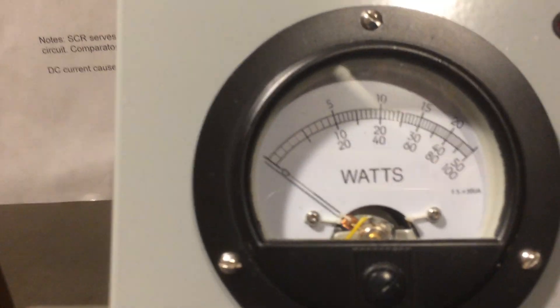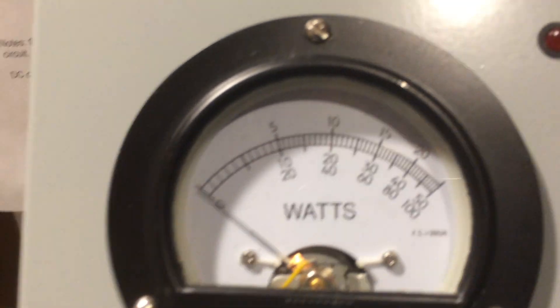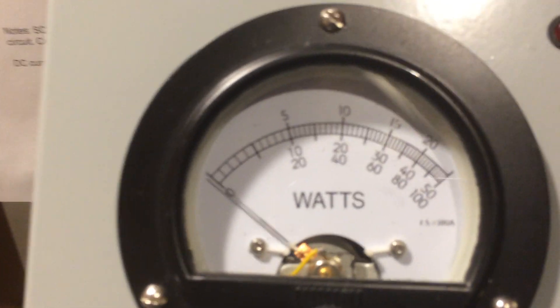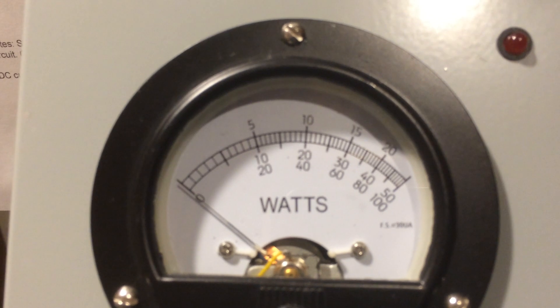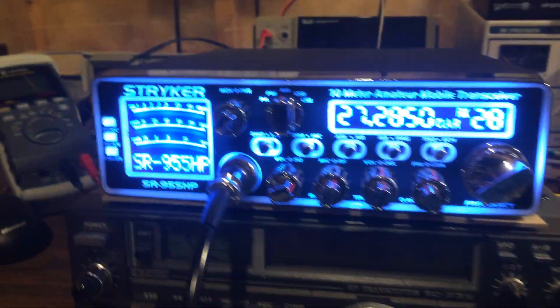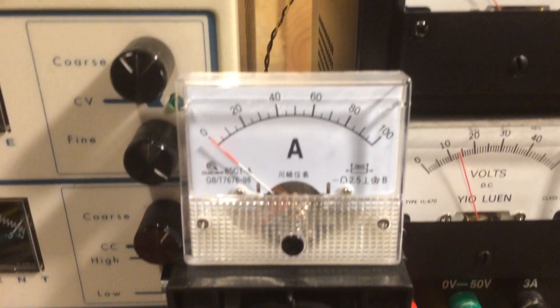My wattmeter will be using the top scale. This does have a peaking kit in it, so we'll be looking at the dead key or RMS value, and then we'll be looking at the swing. I've got the volume turned down so you can hear my voice. I've got about one watt drive. Remember, LDMOS — they're low drive devices.